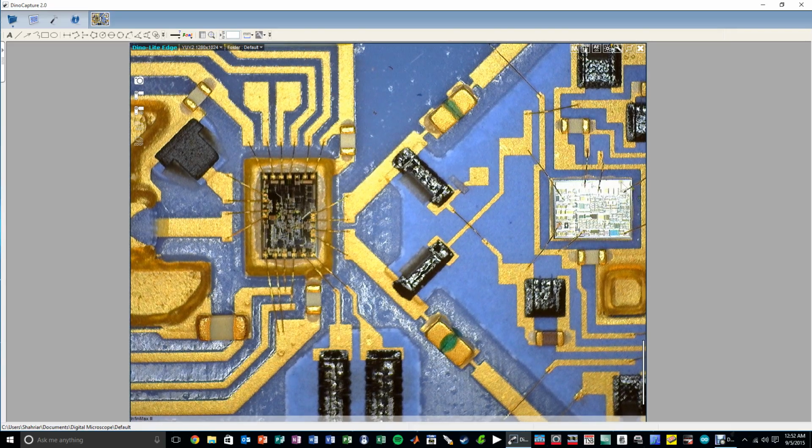This chip seems to have much finer lithography. Probably, I don't think it's indium phosphide anymore, but interesting nonetheless to see. Like I said, I believe these are decoupling caps, and so you have this two-path solution going on. But you can also see the blue material. You can see the input of this micro-coax here directly being fed with this microstrip transmission line. Decoupling caps more close by to the IC. You can see the bottom of the IC, which is the ground where the IC is sitting on, decoupled to these lines. All microwave design.